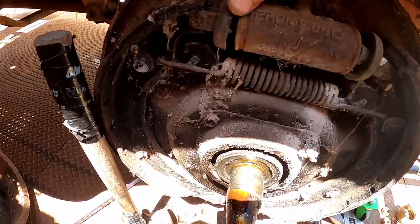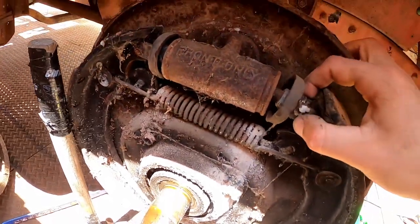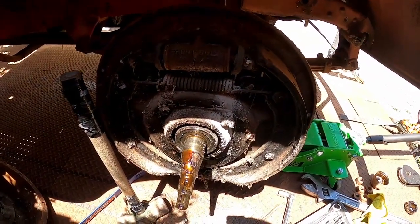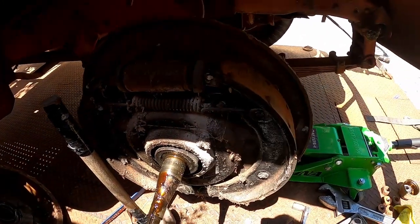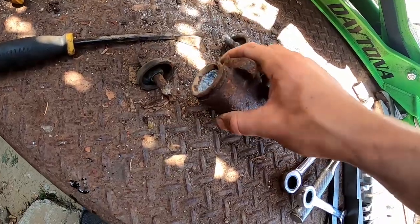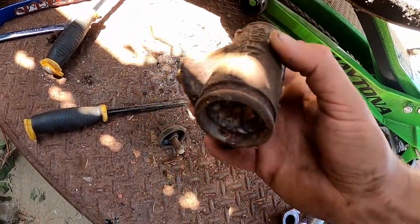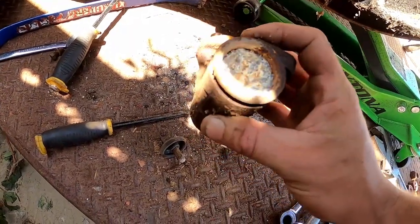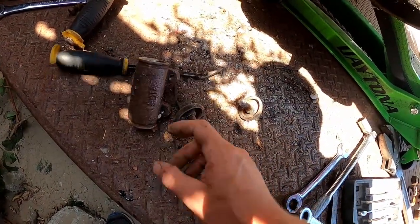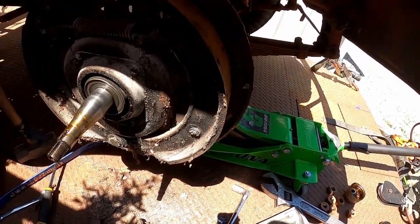Both sides are completely full of white chalk and the shafts are rusted, so I'm not going to waste a lot of time trying to get it to work — it's pretty much shot. I'm going to remove this piece and reassemble so I can get this thing rolling and figure that out later. I was kind of thinking I might throw a newer axle in this thing, but I'm not making any promises yet. This piece is out and you can see these cylinders are just full of some sort of chalky residue.